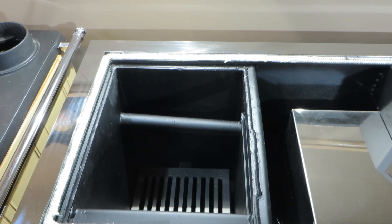If you're doing radiant baseboard, it's a different story — you'll run 140 to 160 degrees through that baseboard, depending on how efficient it is. The newer baseboards require less temperature because they're more efficient. If you've got one that runs at 150 degrees, that means you can only pull 50 degrees out of your thermal battery before you're out of heat. Once you get below the threshold of 150 degrees, it's not hot enough and it won't keep your house warm. Hopefully you can understand this — these are the facts of how hydronics work in a house.